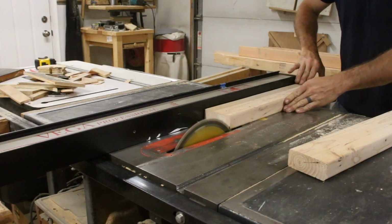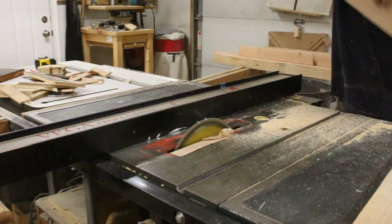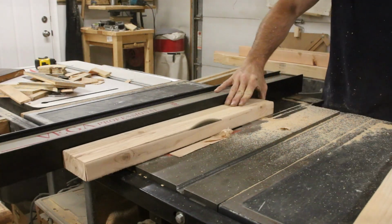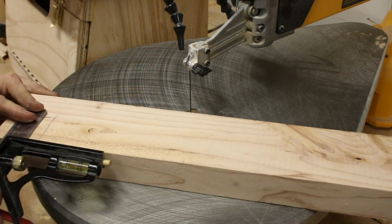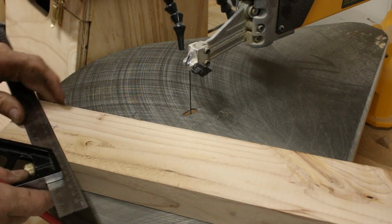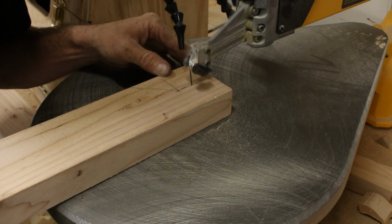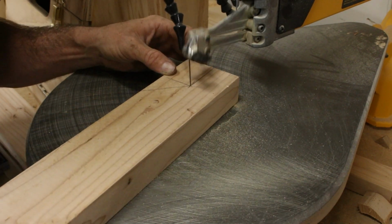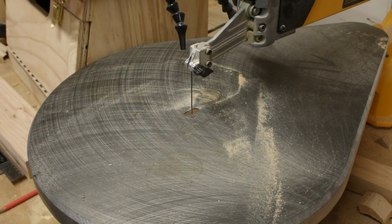I needed to mill the sides off of these 2x4s so I had nice sharp corners to work with. Those of you who are wondering, yes, I'm still sick. There was no structural reason why these had to be so thick. The only reason I'm making these out of full-size 2x4s is because the blade sits so far forward from the front of the mill, and the thickness of the 2x4 gives me enough spacing so that my bearings end up in the right spot. I ended up cutting a relief in the bottom section so that I had room for the bolt to fit through. This way I didn't have to go buy any specialty bolts.